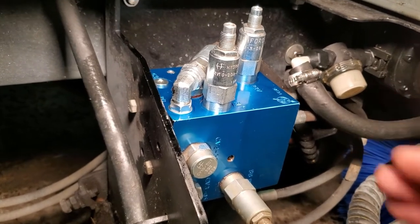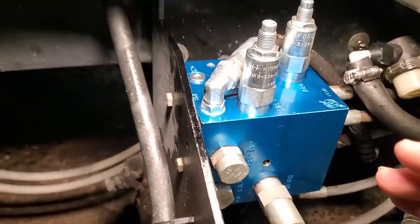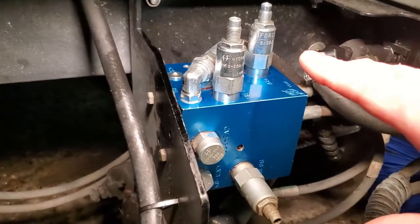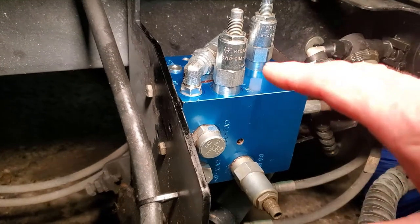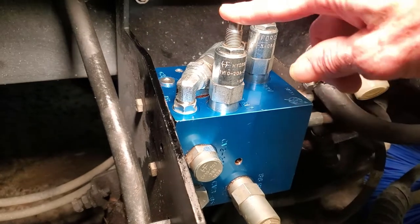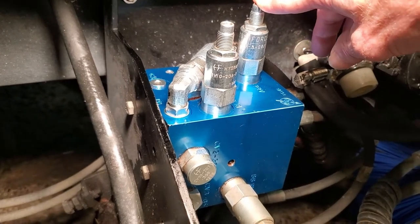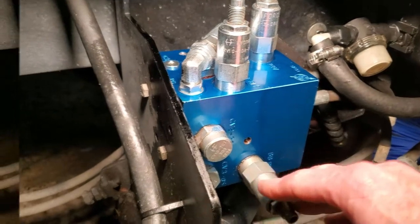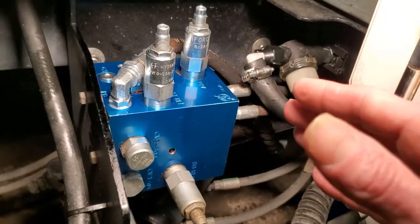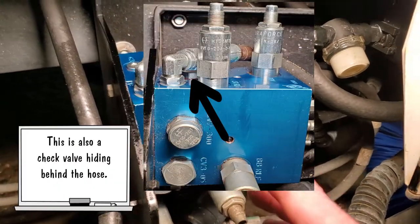I want to give thanks to Don Zamboni for the patience and the kindness to explain everything to me because I had tons of questions and I didn't really get it at first. He explained it to me and emailed me some diagrams. We'll take a look in a minute about how this thing works, because this is not only for the board brush, it's also for the steering mechanism. This right here is a pressure relief valve for the steering relief. This is a pressure reducing valve for the board brush arm stop. And this is also a pressure relief valve for the board brush motor if it gets stuck. We'll go over to the bench and take a look how this thing works. And there are also two check valves for the system.